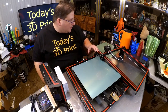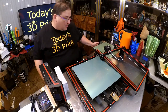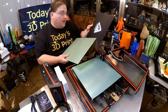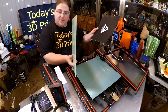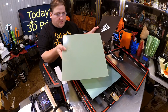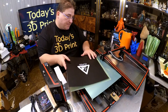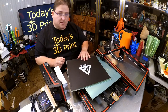The steppers are loose as crap — we might not even attach it anymore. Aluminum PCB, steel Y-carriage — garbage, we'll get to that in a minute. It'll be annoying. Instead of using a piece of glass, they have a piece of fiberglass. That's interesting — it is flat, I'll give them that, I don't see any bows or bends in it. And then a BuildTak ripoff — that standard Chinese build surface material. Although I hear you can print directly on fiberglass, so I might just try a glue stick and fiberglass and see what happens.